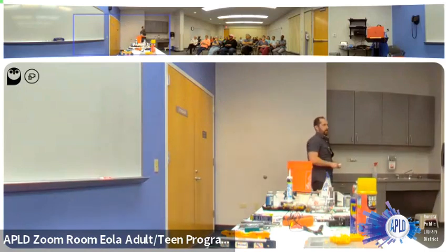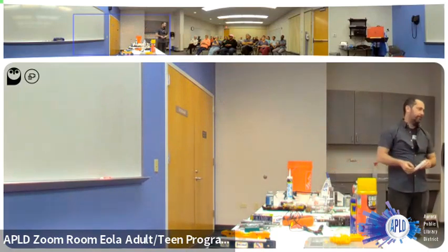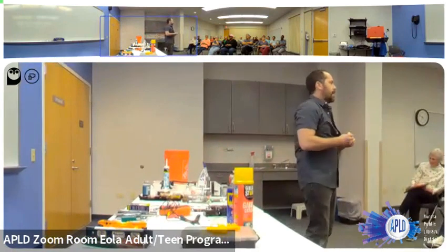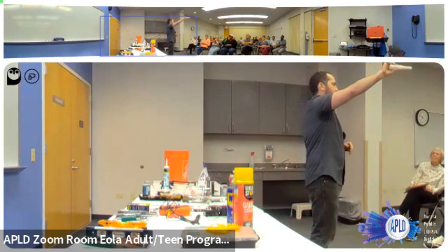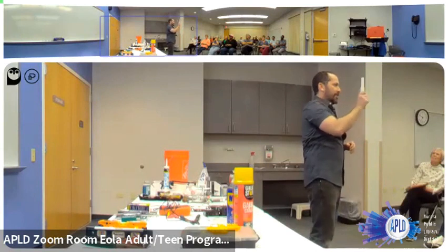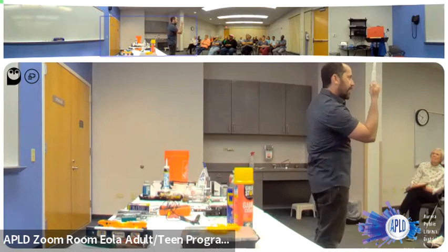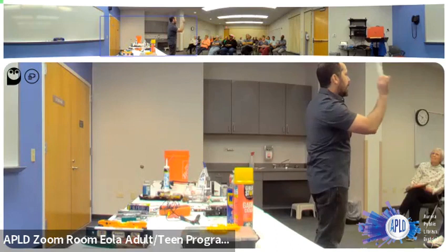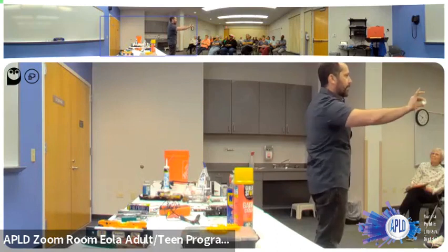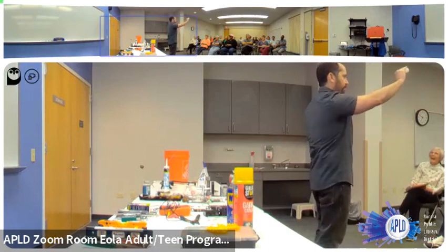Additionally, there's one exception to keeping those lame Allen keys that come with your furniture. It's any time a tool, this is not really a tool at all. This is a plastic molded nut driver. This is a piece of garbage. But it's just the right length and exactly the right size to put in the nut on the bottom of a given faucet. Keep this tool right there, put the faucet in, and then take this to the wall.